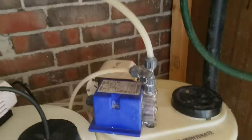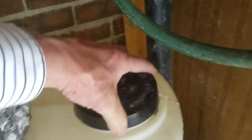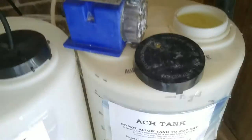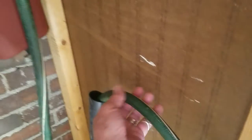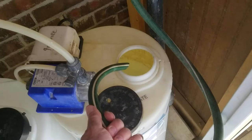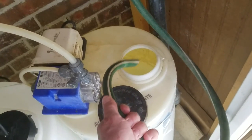For example, say the level in the tank is at 38 percent. Go to the tank that's low and take the cap off — there's a childproof lock, so you have to squeeze the cap to get past. When you take the cap off and the tank reads 38 percent, put in a half a gallon of the ACH chemical and pour that into the tank. Then go to the hose bib, take the hose sitting in the drain pipe, put the hose into the tank, and fill it up to add 50 percent of the quantity you had measured. So if it was at 38 percent, you bring the level up to 88 percent, because you added a half a gallon — and a half a gallon is enough for half a tank.